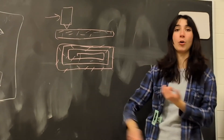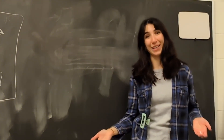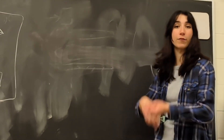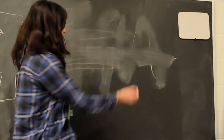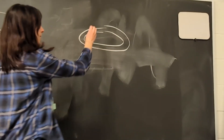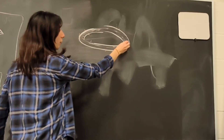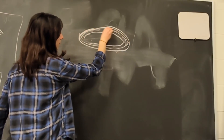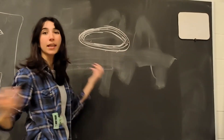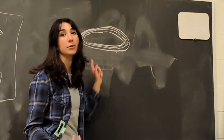Making 3D printed parts like this not only harder to predict but not really leveraging that fiber reinforcement. Continuous fiber is exactly what the name suggests — instead of chopped fibers you have long fibers that can fill out a whole layer and follow the toolpath. With chopped fibers when I print this ring they exist following the toolpath, but continuous fibers allow me to reinforce the long strands of carbon fiber or glass fiber following the exact geometry of the layer. That way when I pull this, I have the strength of the filament and the strength of the fiber working together to make a strong part.